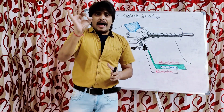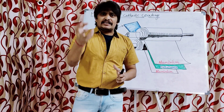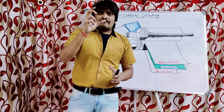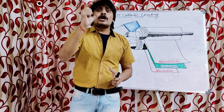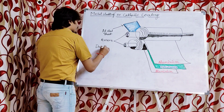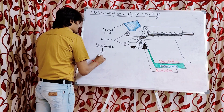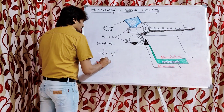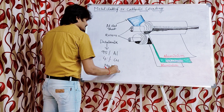For manufacturing aeroplane parts, this particular metal cladding is used. In the manufacturing of aircraft or aeroplane parts, the base metal is duralumin. Duralumin is an alloy of 95% aluminum, 4% copper, and the remaining amount is magnesium, iron, and manganese.